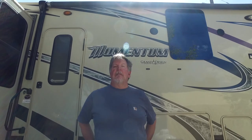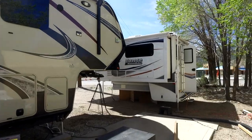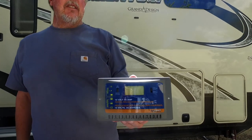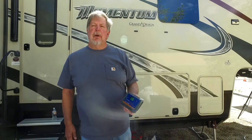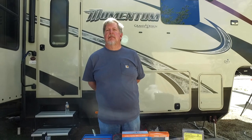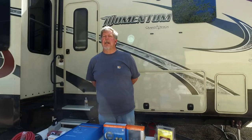Good morning, YouTube. Today we're going to be talking about doing a new solar install on the Lance 1181. If you've watched our videos, you have seen that we bought Battleborn batteries before we went to Mexico and installed them. The problem was the Lance camper came preloaded with a 100-watt solar panel and a PWM charge controller. I took it out the same day I put the Battleborn batteries in and put in a Victron 130 charge controller to more properly charge the lithium batteries. We never had any problems — I never ran the generator in over two months on the road in Mexico. That's a 100-watt panel.